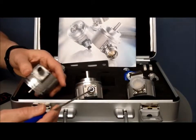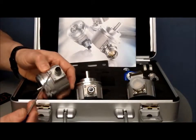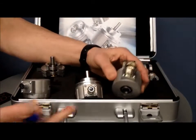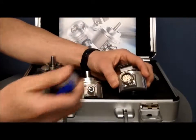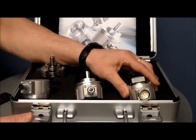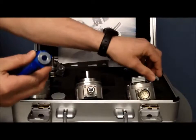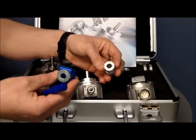In addition to that, the units have a variety of connecting modes: the standard cable gland, an M12 8-pin connector, and the industry standard M23 with 12-pin arrangement as well. In addition to those, there's a variety of couplings and other accessories available.